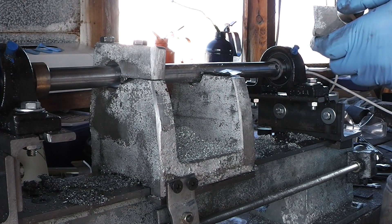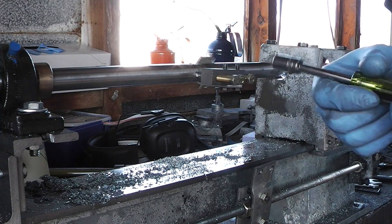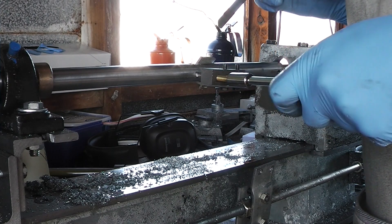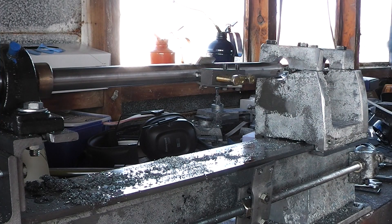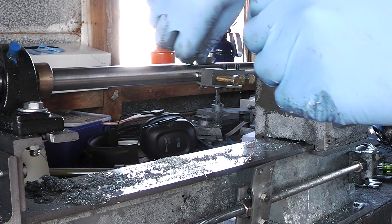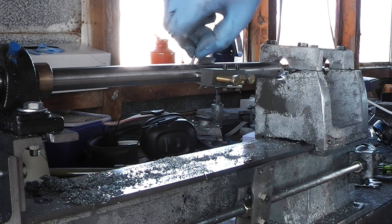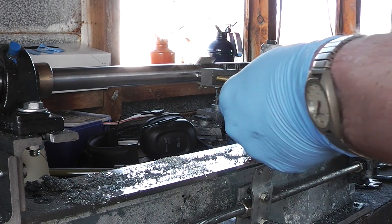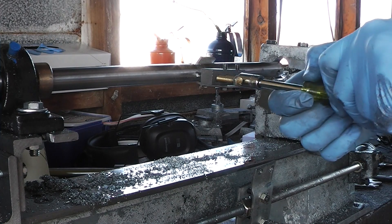Achingly close. Right, wind this into exactly where the cutter is - the feeler gauge. Now there's a distance of exactly the feeler gauge between the cutter and the nut there. Push the cutter out that distance of the feeler gauge. Back this off first so that when I release the pressure on this it won't slam into the cutter.